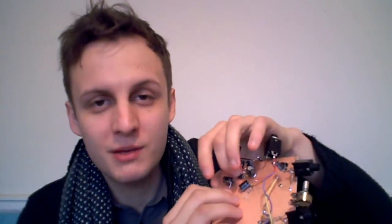I went a little overboard and got a chip called the TDA2822M — it's one watt per channel, which is a ton of power for headphones. Same thing, really simple circuit: input, go to the chip, it gives me a watt and some gain, and out, with a battery hookup. Super simple, and this could be well under $30 for a kit. Big problem: this thing is not stable — it'll oscillate and won't behave well at anything under 20 decibels of gain, which is a ton. So you're going to deafen yourself very easily. It's also a little noisy. This chip is really meant to drive little speakers — headphones are little speakers, but they're too small for this. Great chip, but overkill for our application.